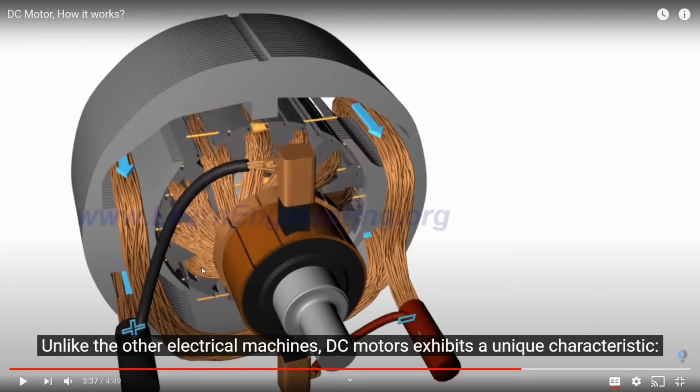The idea is that the reality of these motors is you have to connect it to something to do work for you, and that thing might require very little work, or it might require a lot, and that's the load. So what he's saying is that one type starts up with a lot of torque, but then as soon as you put a load onto it, it kind of slows down.